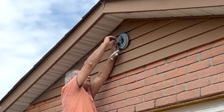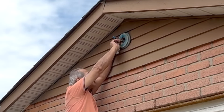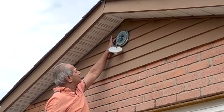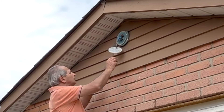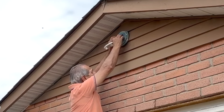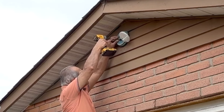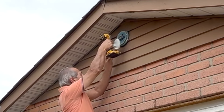After tightening the wire nuts, I wrapped the three wires with black electrical tape — a good idea for an outdoor installation. I fixed the round wooden block using the same old long screws. I was thinking why the builder didn't use an electrical outlet box, which would have made the job much easier. Then I securely pushed all the wires back inside the wooden block and installed the mounting bracket with the screws that came with the package, keeping it horizontal.